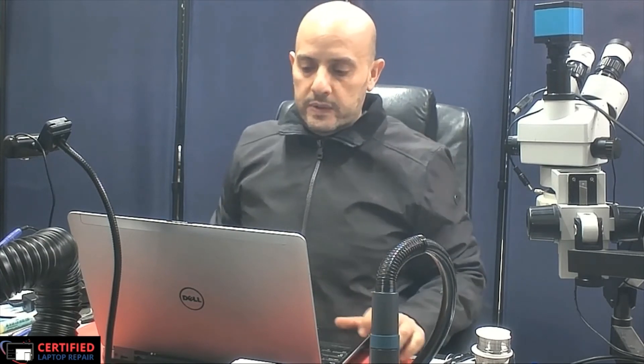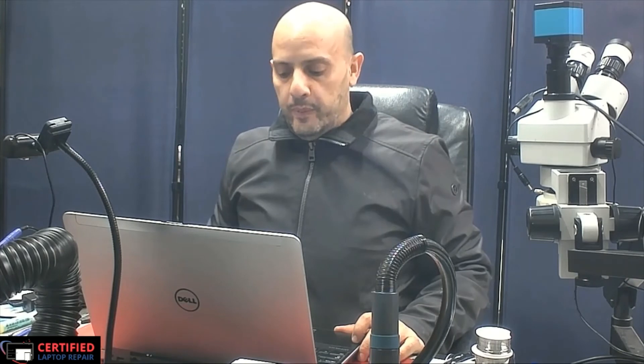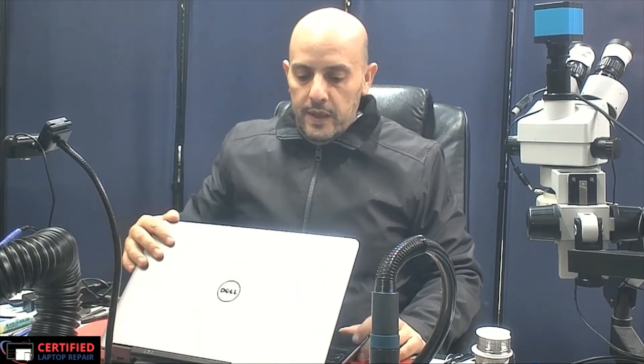Quick wrap-up: we got a computer that was tested on the power supply without a battery and it was drawing 2.5 amps, which is not normal, so we knew there was a short. We took it apart, pinpointed the short, and using the thermal cam we identified the capacitor responsible. We replaced it and got a fully working computer. Hope you enjoyed this video — don't forget to like and subscribe, and I'll see you soon.